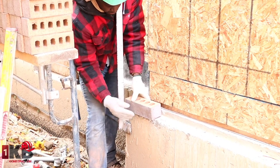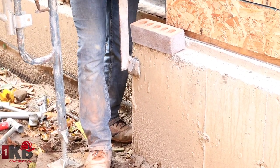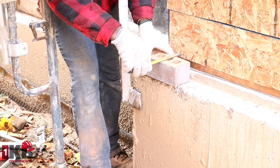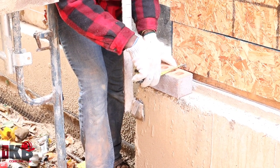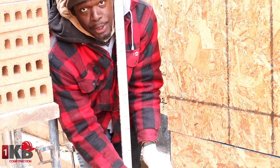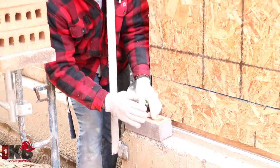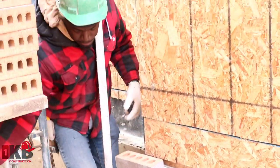The reason why I put my brick tie right here is because I want my brick sitting off the ledge — the concrete foundation — at least half an inch. From the wall itself, you want to measure four and a half inches; that's where we want our corner post to be, that's where we want to put our bricks. That space is there so that later on, in case they want to do parging, you can easily parge it. We don't want it flush or inside the ledge because the parging will come right over and toe onto your brick. So we sit it right here — four and a half inches outside — let's plumb it up first.